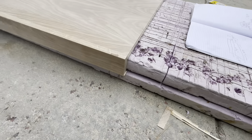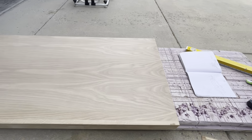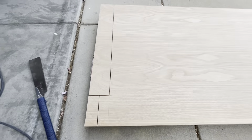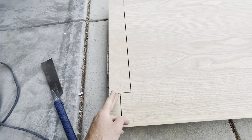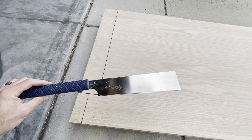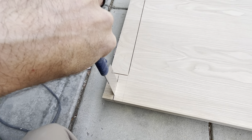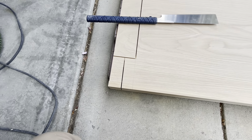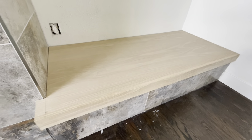I used my track saw to cut this — it's not quite a 3-inch depth due to the track being in the way, so I'll hand-saw that out. I got the angle cut on the right side, measured over, and laid the track out on my marks to match the side. You can see this angle is not quite 90 degrees — that's to match the tapered front where it's tiled. Here's the saw I'm using — they call this the razor saw. These are great: you can put it up against the side, hold it with your hand, and it follows the initial cut. Much easier and less messy than a jigsaw. That fits just about perfect — pretty happy with that.